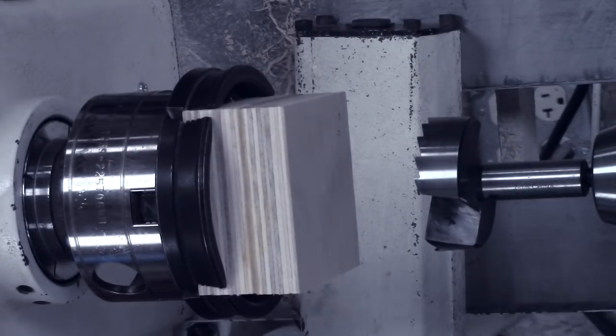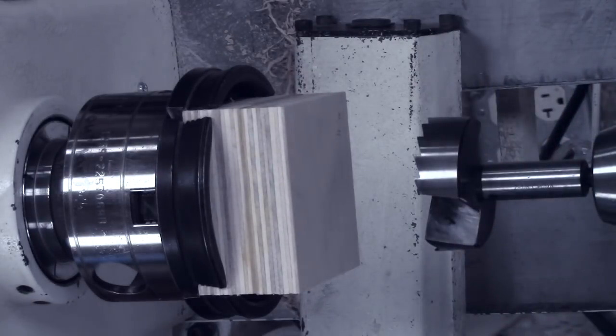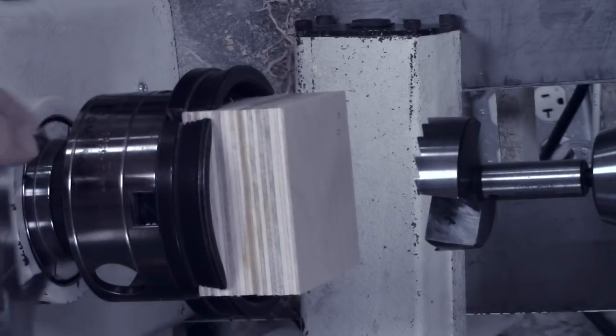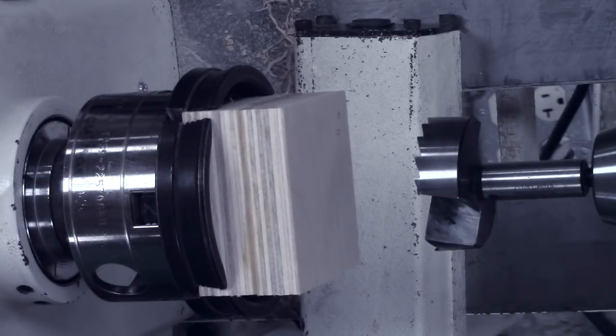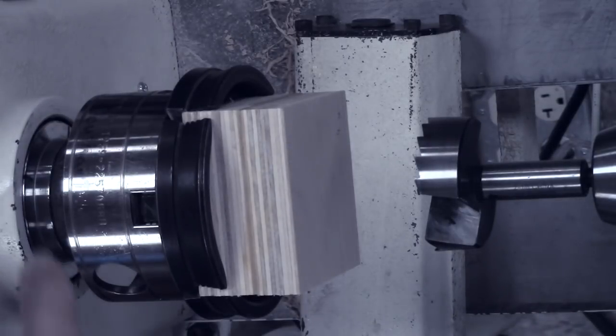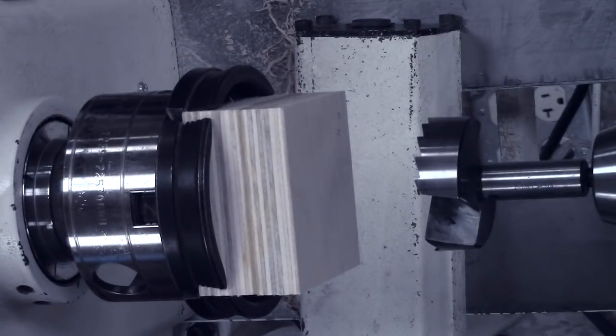And that's equal to? It's slightly larger. I think this diameter here is just under 2⅛, and that's a 2⅛. So it's just as long as it's bigger than this face here. So I want a completely milled surface that is going to rest against that face. I don't want to have a ridge on the end that's going to make it cocked. And for the Forstner bits, I'm going to run the speed at about 400 RPM.